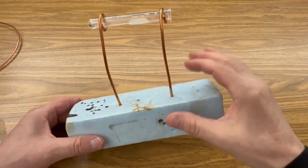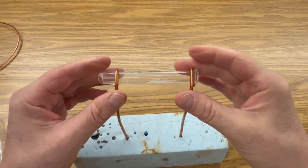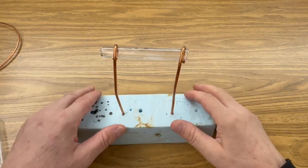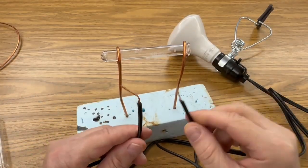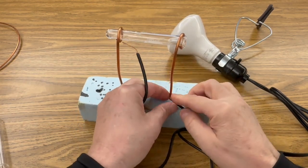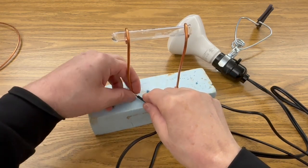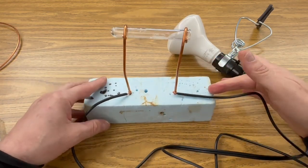Finally, I'm sticking both electrodes into a styrofoam block that'll serve as an insulator. If you don't have a good connection to the glass, just turn your loop a little bit so there's just enough pressure on the glass so when we heat it up it can provide some conductivity. Now take the two exposed ends of your socket extension and wrap them around each side of your electrode on the base of the styrofoam. So it should look like that.